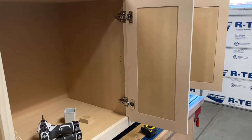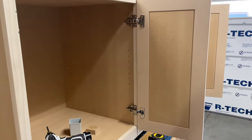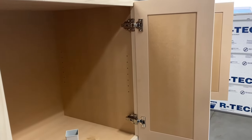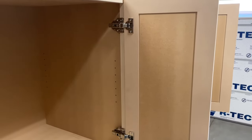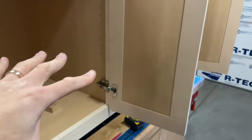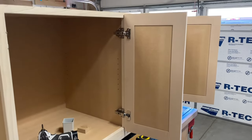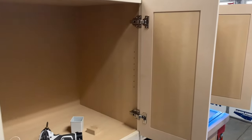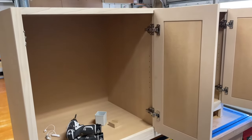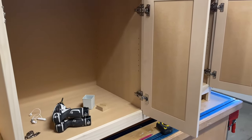Your finishers aren't going to love it because they won't know which area to put them on — it's going to get confusing. I like to put my soft-close feature on the top for lower cabinets, and for upper cabinets I reverse it — soft-close on the bottom, regular at the top. It depends on how big your doors are. You could also have three or four hinges on a really big pantry door. So what do you do there?